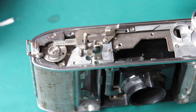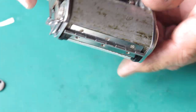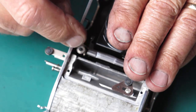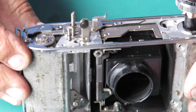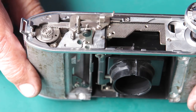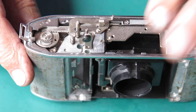When I disassembled the camera there was a shim underneath one of these plates, which would have had the effect of allowing more play between the rack and the mechanism. Often when reassembling an old camera it's worn to such an extent that you don't need extra shims — there's already enough free space just from wear and tear. So that part is looking pretty good.